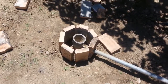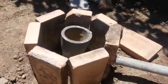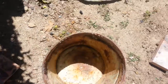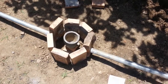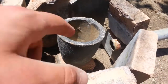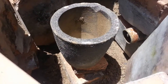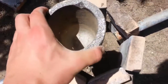So this is what it's gonna look like — not very pretty, but let me explain. The problem with the last one is that it just didn't get up to temperature even with more coal and more wind. This is the base model. The way this is gonna work is I've got two tubes running cold air into here. The difference with the last model is that the tubes used to funnel down to the bottom of the furnace, which was heating up the wrong area because of the crucible being on top.